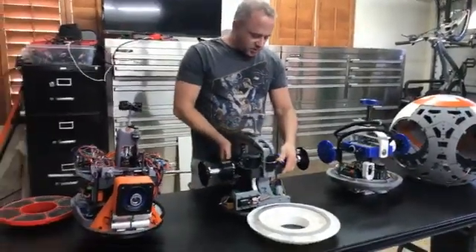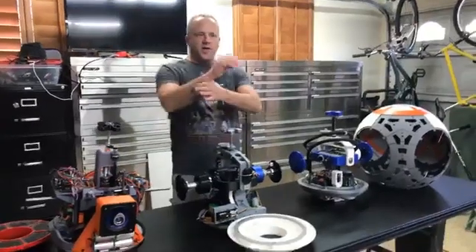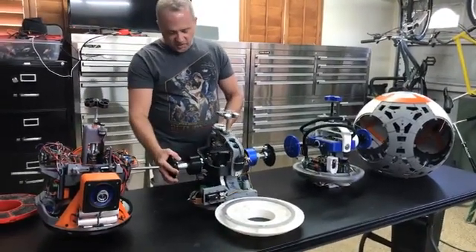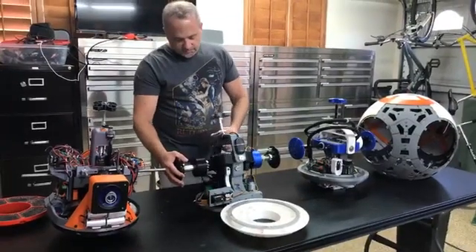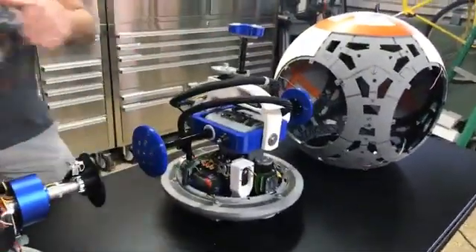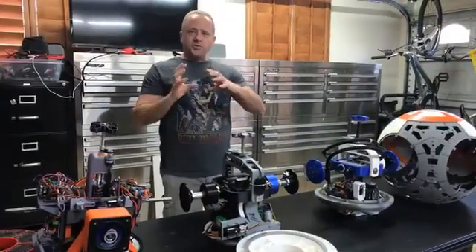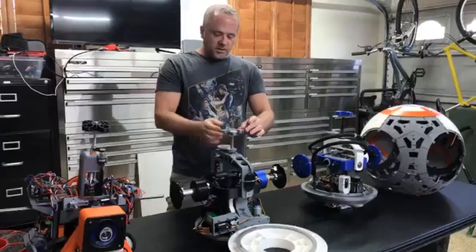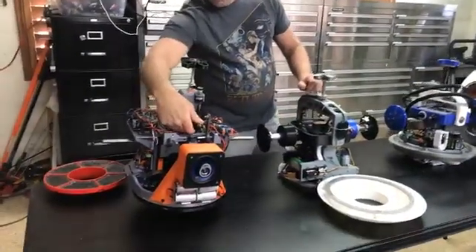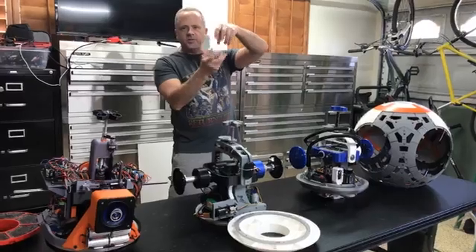As far as the head control and the rest of the body, everything just kind of hangs off of this axle in the center box. As far as how the head actually moves around, these two are extremely similar — they have two different boxes that actually move forward, back, and side to side. That's what allows the head to move around in any orientation, no matter where you want it. And when we rotate the magnets on top, these two have servos that rotate via gears and Joe's is using a motor down here. But it's all the exact same concept — we're rotating the magnets which are attached to the head, which in turn rotates the head.